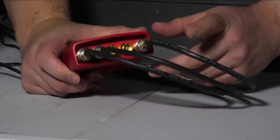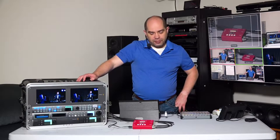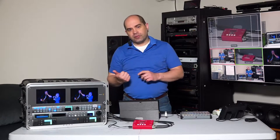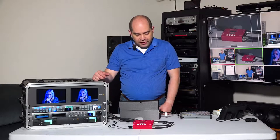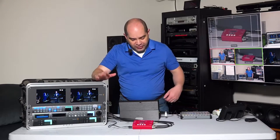On the right side there are a total of five SDI jacks: one input, two jacks for output one, and two jacks for output two. Output one can either be a loop-through of the input, a copy of whatever's on HDMI, or it can be the down converter. The device supports conversion in two different directions — HDMI to SDI, SDI to HDMI — and you can do both at the same time. It also has a unique ability to output two different signals on some of the SDI ports. Because it's fully configurable where your inputs get sent as outputs, this can actually be used as a 1-to-4 distribution amplifier while simultaneously converting an HDMI input to a different video format. So the device is actually very flexible.